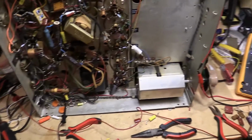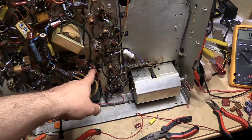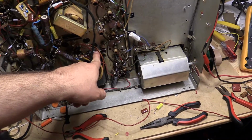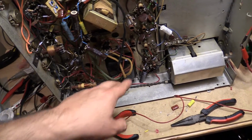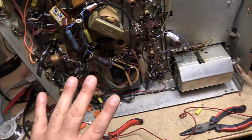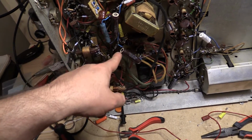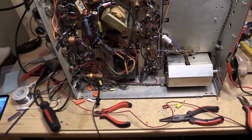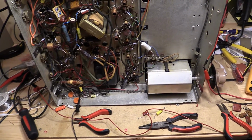And the only people that are going to know that this has been redneckicized. I've got the 27 microfarad tacked in here, another 27 tacked in here. Don't ask, if I put these two together it starts messing up the picture. I have no idea why. And I have a 27 microfarad here between the two resistors. I'm probably going to end up going through 5U4s, but we'll see.